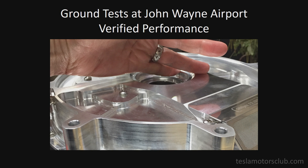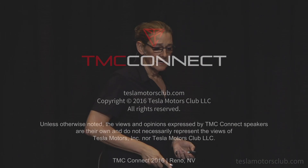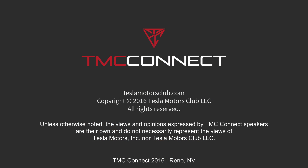It's a Yasa electric motor. The challenge for us was to have an electric motor with the performance we need but at a relatively low RPM, because ultimately we have to couple all of this to the main rotor. Yasa was able to deliver better than any other electric motor out there. This is not one they currently have for sale, but they produced it and plan to make it available for other applications — it's something off the shelf, but not yet commercially off the shelf.